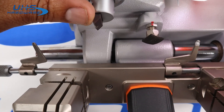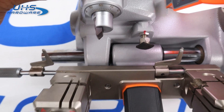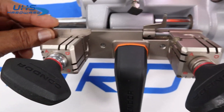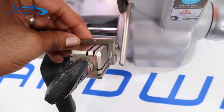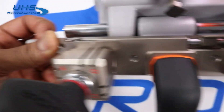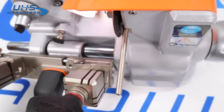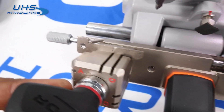Here we have the guide for the mill cutter, and the mill cutter itself — you can see they have the exact same shape for accurate alignment when making adjustments. This is our alignment shim; it fits right inside the clamp. This cut edge gives us something to align to — you line it right up at that edge and tighten it. The shoulder stop guide can show any difference in alignment; if the shoulder stops are not equal, you loosen up and move it back to exactly where you need it.